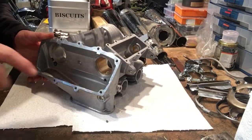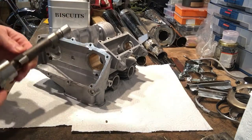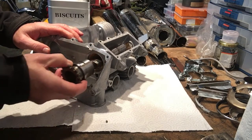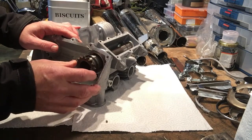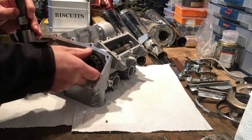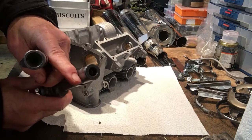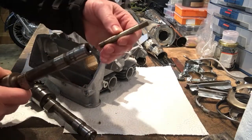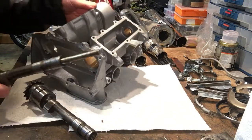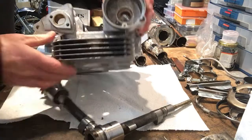With this, just a moment, getting low battery. One of the beauties of this design, and you'll see this when we're building it, is you've got the ability to insert or remove cams with the head in situ when you need to shim up the tappets. And the cams look identical, but they're not, because I've got these the wrong way around. The end of the exhaust cam is drilled to take the stud that drives the auto advance unit. So the stud pops out of this end to drive the auto advance unit in this cavity here underneath the points.